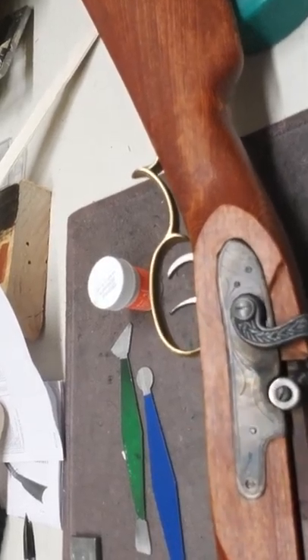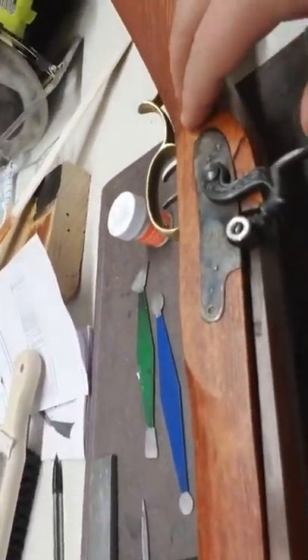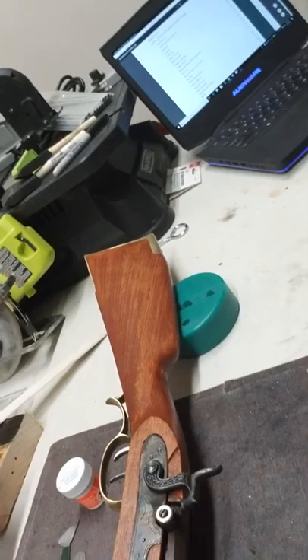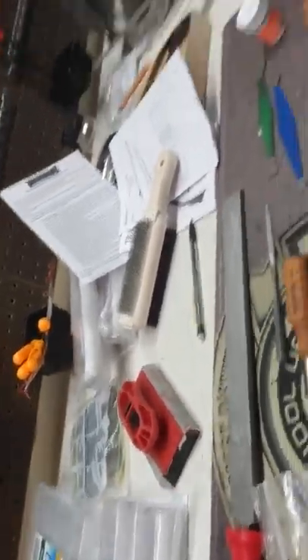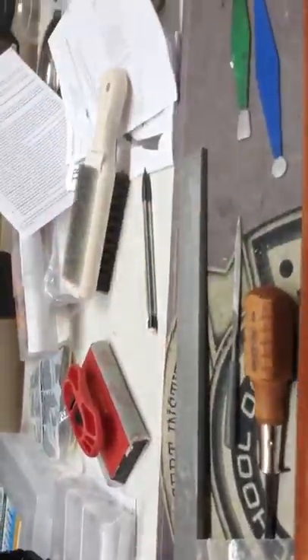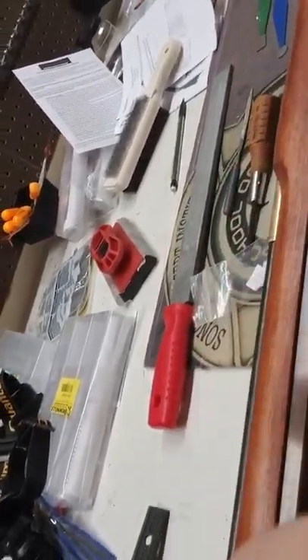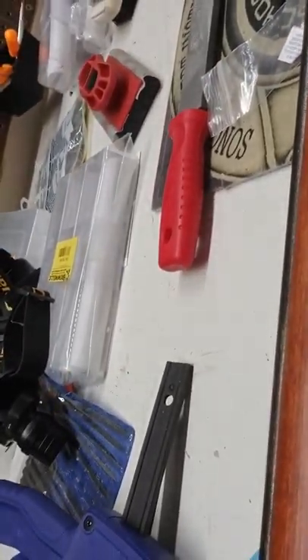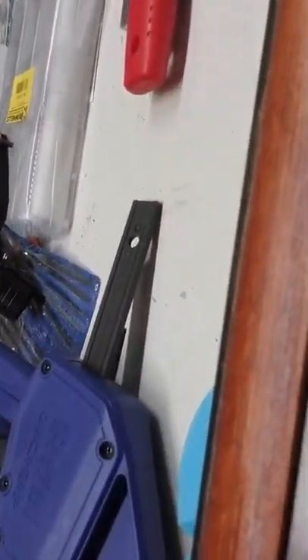I have video of me shooting at the range yesterday. After that was a little bit of sanding of the stock, just making sure it was all nice and smooth. The barrel tenons were actually done before cleaning this up — lining these parts up here. You can see the holes drilled through the stock, inserting the barrel tenons, using the needle file to smooth out the metal for the dovetail on those, making sure they lined up and drilling through the wood and the metal all at once. There are a couple little pins in here that hold them on. You can see a little bit of damage here to the stock — one of the pins went in crooked during final assembly and actually took part of the stock out with it, which I had to repair with wood glue and epoxy and then sand down again before finishing.